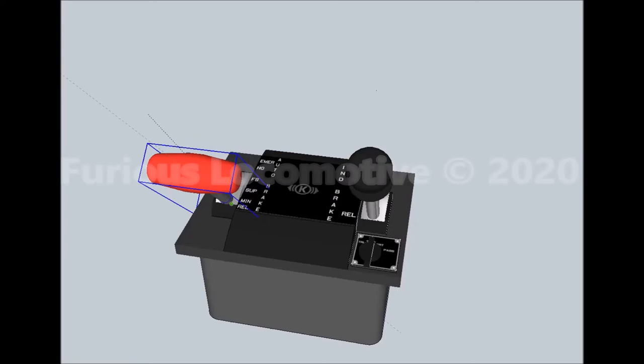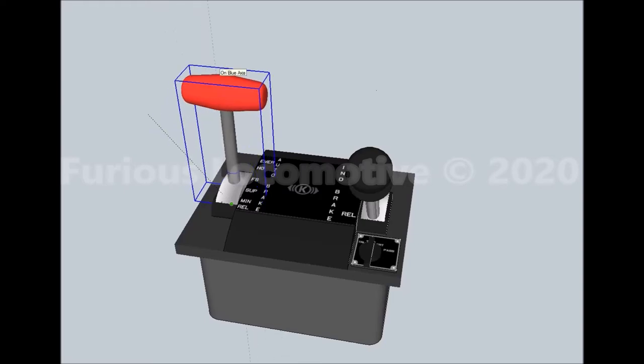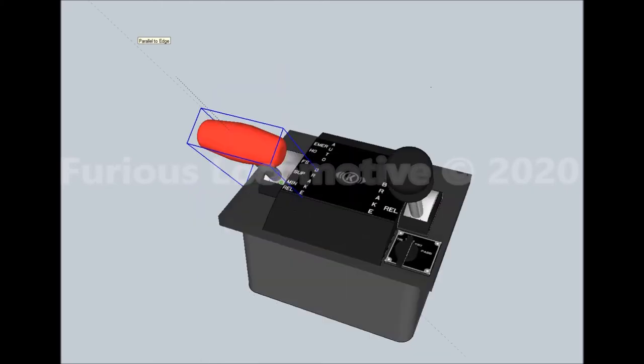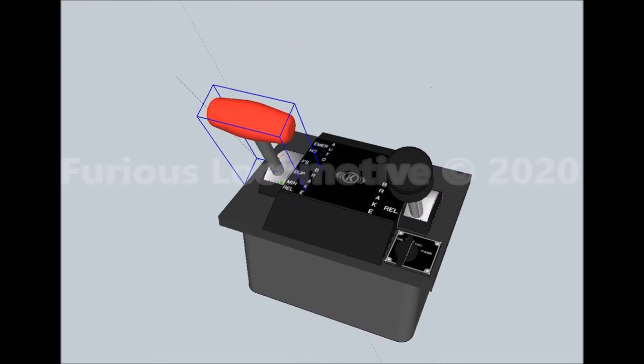The air brake controller is on the right side of the console. The automatic air brake handle operates to 6 positions. They are: release, minimum reduction, suppression, full service, handle off, and emergency. The service zone is between the minimum reduction and full service positions.